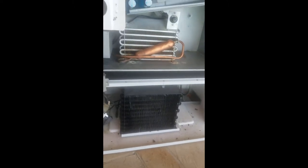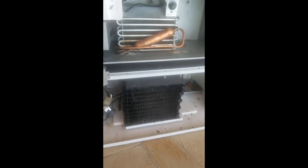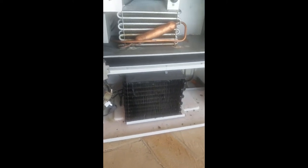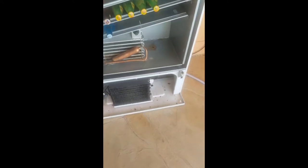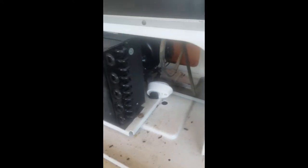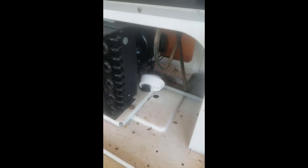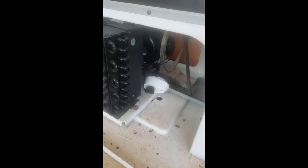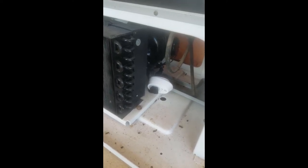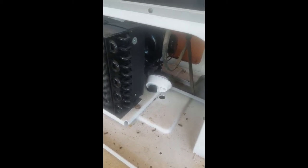There's the condenser, the evaporator, and the compressor behind that. The way I turn these off is the condenser and the compressor just have a plug — there's an outlet that was originally there, and that's how it was designed. So I thought I'd just plug a Wemo — one of those remote control smart outlets — into that plug, then plug the compressor and the fan assembly into that, and it basically worked.